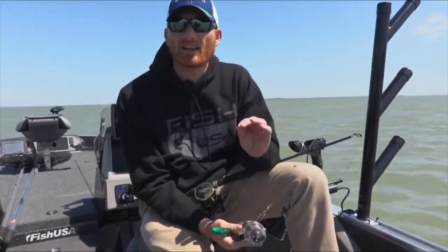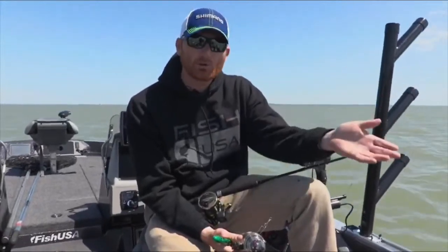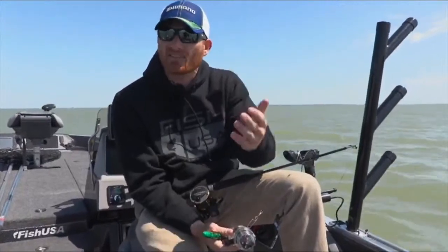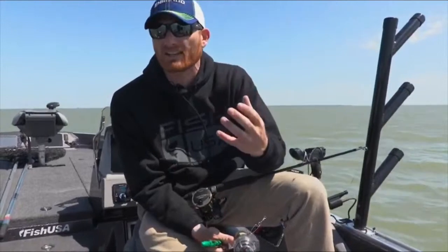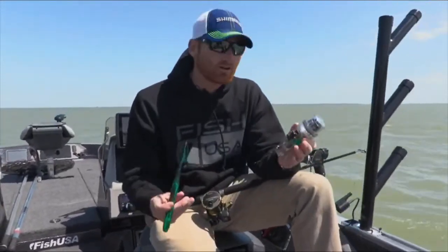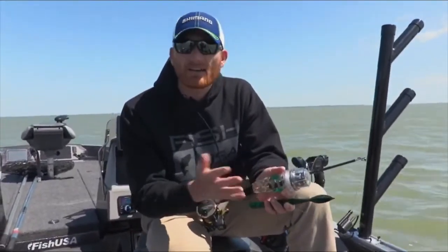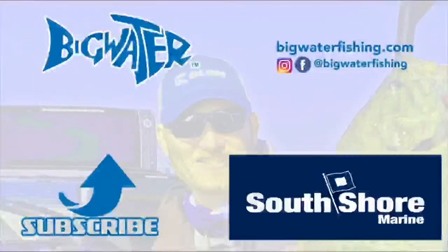Knowing what your lure is actually doing down there, believe it or not, 4, 5, 6, 7 tenths of a mile an hour can be the difference from the set and drift or the way that the currents are changing from your lure to your speed over ground and your GPS. And that makes all the difference between the diving depth, if you're using weights, if you're using floating lines, or if that lure is even working at all. Something like this is going to make it absolutely no questions asked, 100% guaranteed to know what your lures are doing. With an effective speed of 0.8 miles an hour to pretty much as fast as you control, the X2 is going to let us know what our lures are doing.